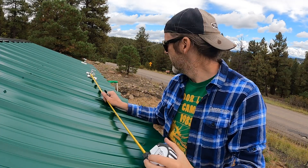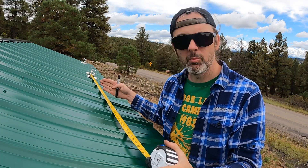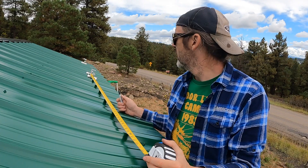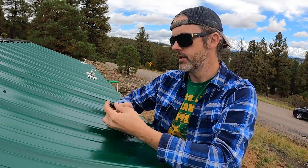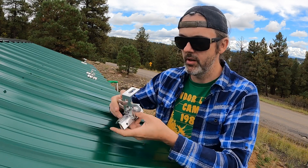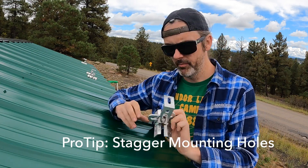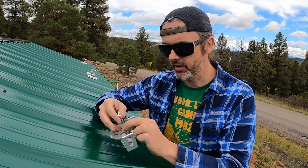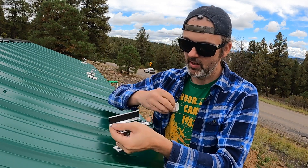Installing these is pretty easy. I'm measuring the length of my solar panel and putting the tilt brackets a little bit inboard — not on the very edge of the panel. Under 64 inches I can fit three of them, so we're putting three in. These things are like Legos — there's a million ways to set them up. What I decided to do was stagger the brackets. You won't need to do that if your ribs are wider, but because these ribs are so narrow the tips of the fasteners would hit each other. Sarah actually noticed that, so thanks Sarah.